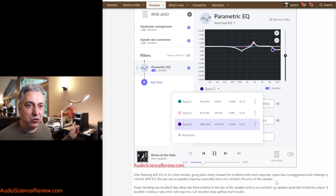One problem with active speakers at lower price points is tweeter hiss. Without a passive crossover, there's nothing to reduce efficiency and absorb noise from the amplifiers and DSP, and at $150 they can't afford state-of-the-art technology. I've noticed this in the JBL LSR series — the three or five inch — where you can hear hiss at three to four feet. This one has hiss, but past about seven or eight inches I could barely hear it. At a listening distance of three to four feet or five feet, I don't think you're going to hear the noise even in a quiet room.